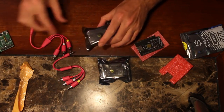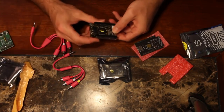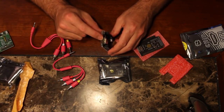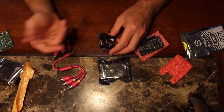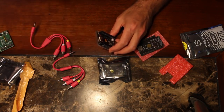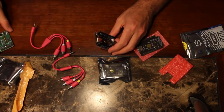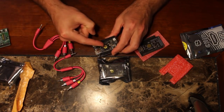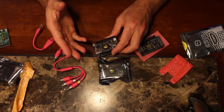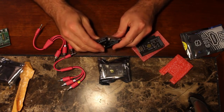So it's great that it came with these cables — I was not expecting that. It only has one standard USB plug, one micro-USB which is for power and OTG, so you can hook it up to a computer and actually access it directly through that, which is something you can't do with a Raspberry Pi. And it has four gigs of flash memory built in, so no SD card, and also has Wi-Fi built in.